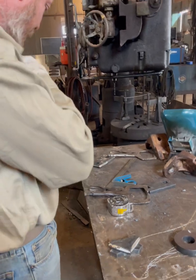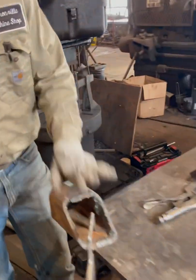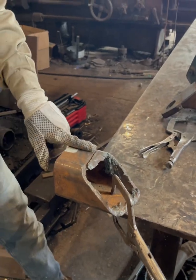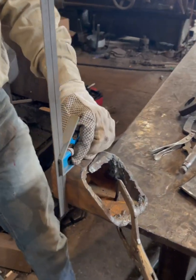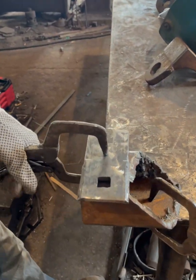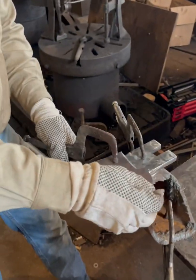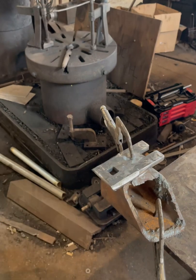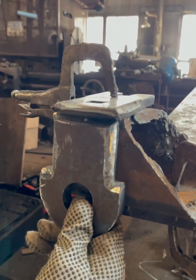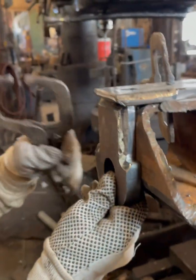Now, we're going to use this drop piece of square tubing as a jig because this is 90. These corners are perfectly square and we want these to be perfectly square. So what we're going to do is put this up here. We're not going to worry about squaring it yet. Okay. I'm gonna put this right here and I'm gonna use this as a way to get me square. I don't want this touching, but there be a gap on this side because I'll be crooked. So I'm gonna put it up there till it's touching on both corners.